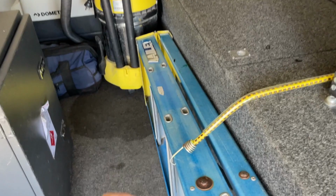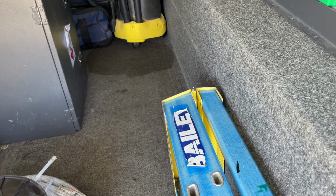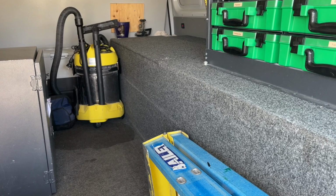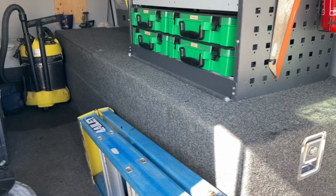It's a bit hard to film because the customer's watching me, but he's a nice guy, he just wants to watch. But all I wanted to say was, before I get in the roof, always make sure that you close the panel on the outdoor unit so no one comes and turns the power on whilst you're on the roof working on it. I know it sounds stupid, but it's happened to me before. I don't trust anyone.